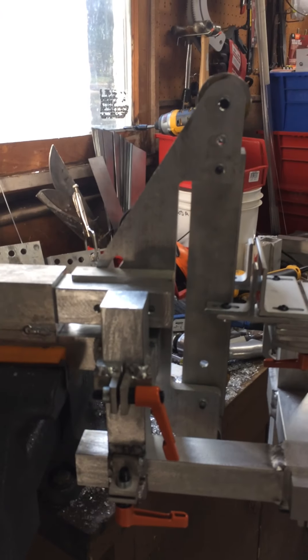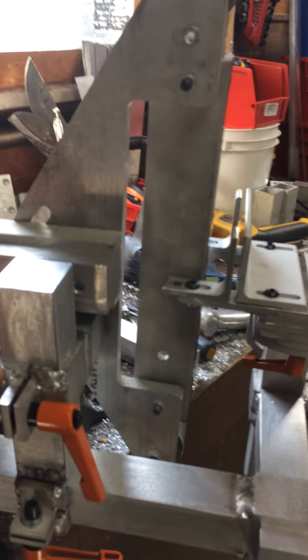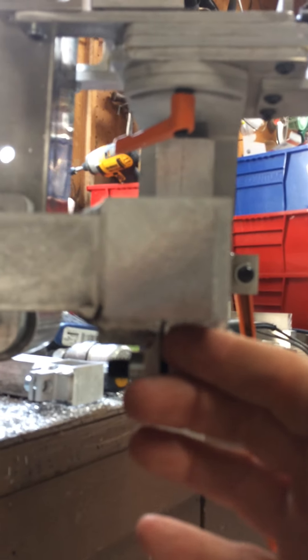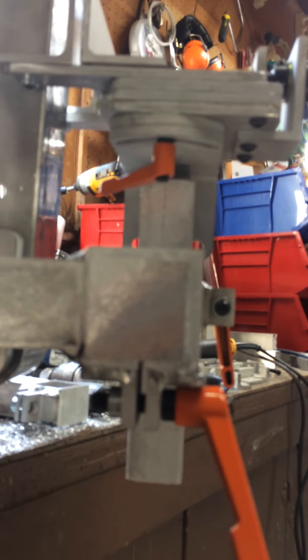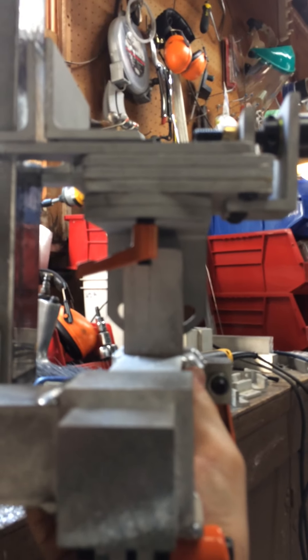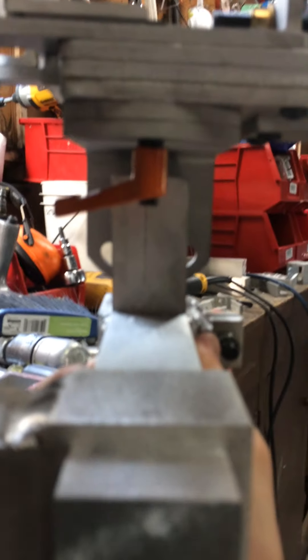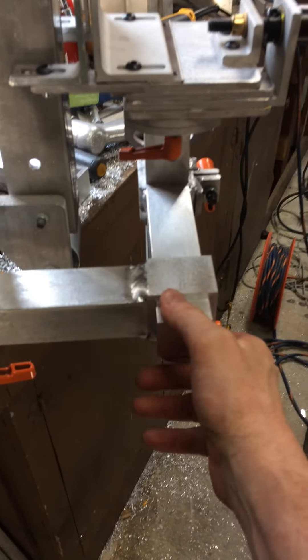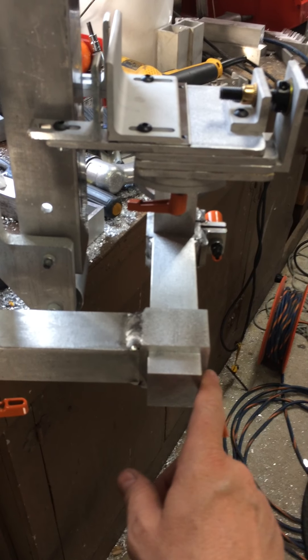This is inch and a half — I've been using solid bar, TIG welded aluminum. You can see that the fit around these is amazingly tight. When I loosen that up it still doesn't come loose, but you reach in there and it's on the thing — it won't slide. You can see the little bit of travel that it's allowed. It slides really easy, and when you center that up and tighten it, it auto-centers the tube or bar in the same place inside the clamp each time.